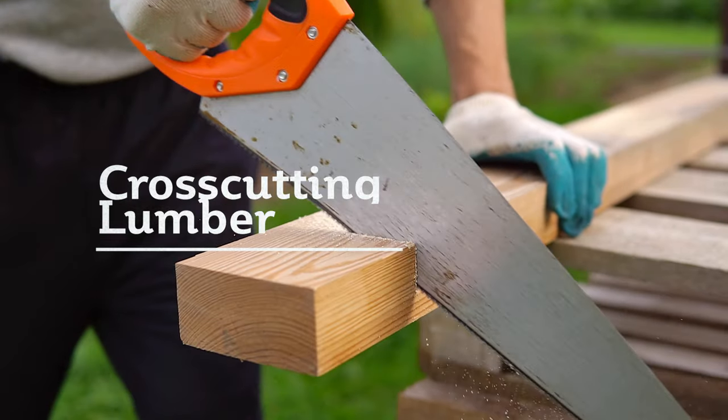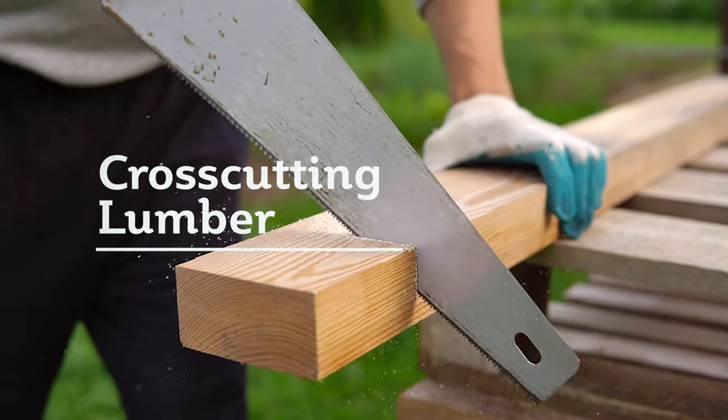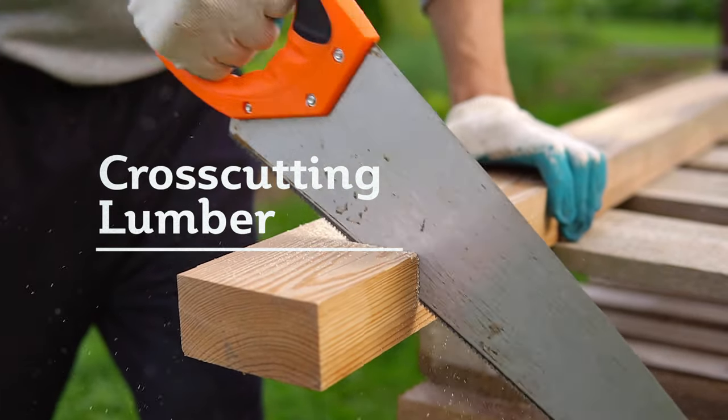Ripping could be accomplished in a few different ways — commonly done by hand using a handheld rip saw. Frame saws were a widely used tool for pretty much any cutting process that would fit between the sides of the frame. You could use it to rip the length of a board or cut a shallow curve. You could also use a table saw, which became prevalent in the late 1700s based on the large saws used in lumber mills. Cross cutting was accomplished primarily using hand saws as well as the table saw.